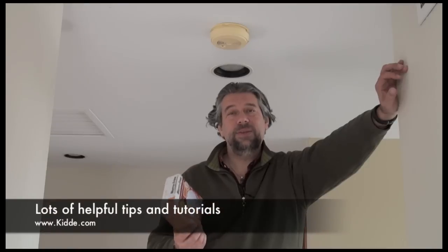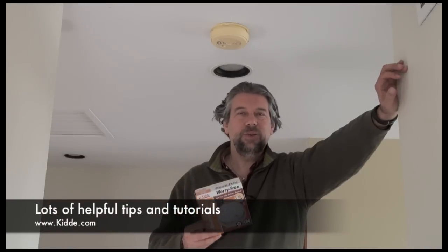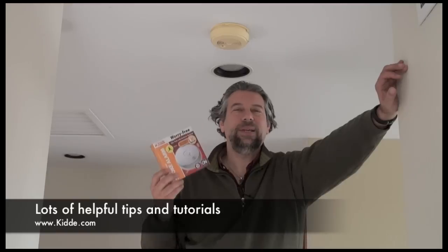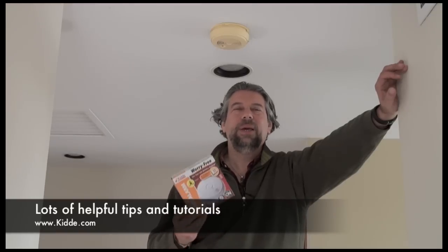Does this sound hard to install? It's not. All you need is to make sure that you've dropped the power to your entire house before you begin to make sure you don't get shocked. It's a bit daunting to think about turning off the power to your entire house and then disconnecting and reconnecting new smoke alarms, and you really do need to drop the power because there's hot leads and you don't want to get zapped. But it's really not as much work as you think.